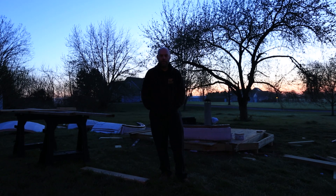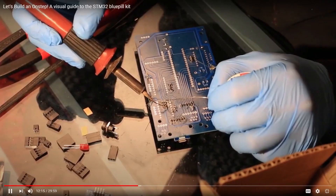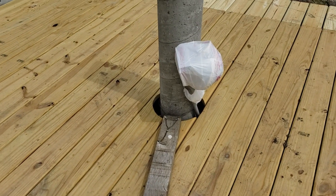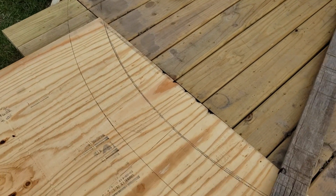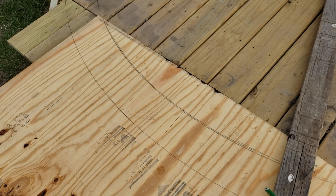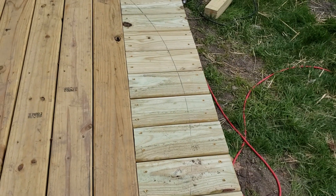You'll have to forgive me if I skip things. Should be a good time. I hope you enjoy watching me build the observatory. I made a little arm coming off the pier with a pencil on it and drew the arc that I need. I'm going to take the router now and cut all these sections of plywood out so we can start to assemble the ring. I used that arm to draw the circle of where the whole dome is going to go.